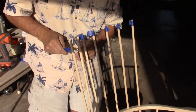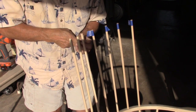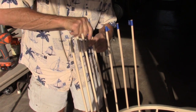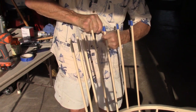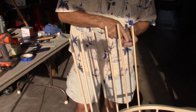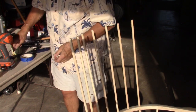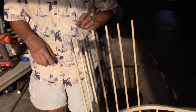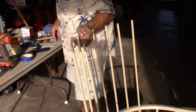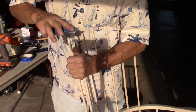My lines are still on there, so that will let me know the depth to which I drive the comb on after it's drilled. Now the top edges are square — what I want to do is chamfer them, so I'm just going to use sandpaper.